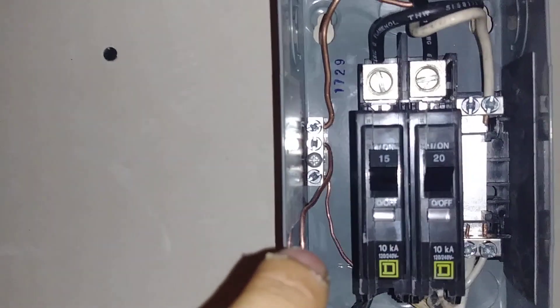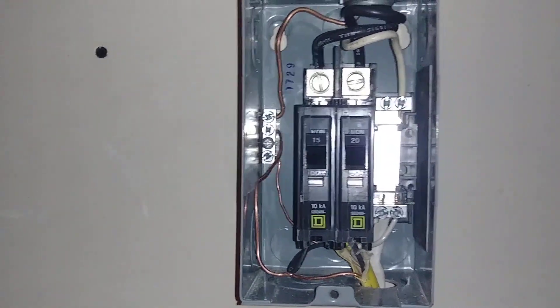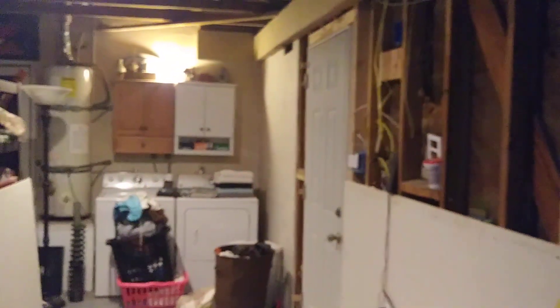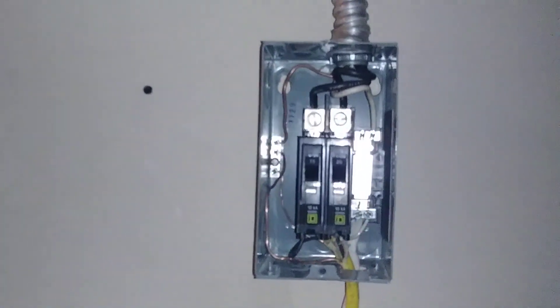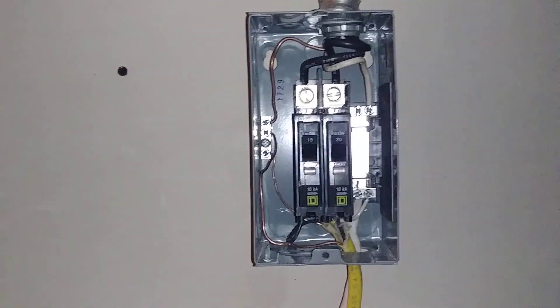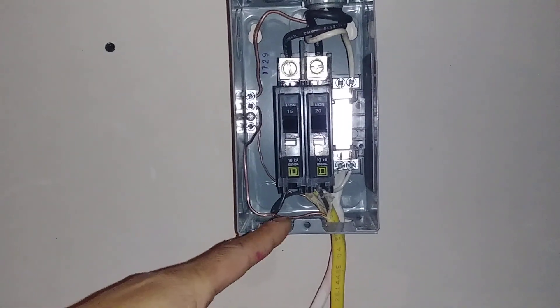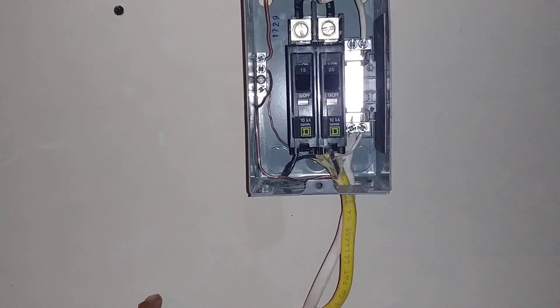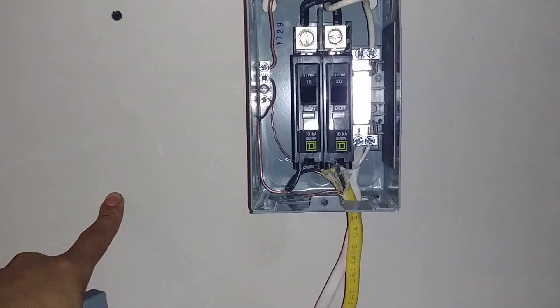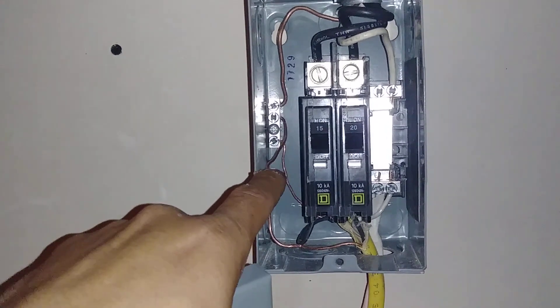The ground wire — let me point at it here — that ground wire is there. So there was no ground wire in that receptacle. I don't know why, I just know that there wasn't any. So I couldn't set up the sub panel over there in the corner to get the wiring on my receptacles and my recessed lighting started. So I had to move the sub panel over here because the main panel is right behind this drywall on the outside. I thought if I moved it over here, it would be easier for me to fish some ground wire into the ground bar on the main panel and back over to the ground bar on the sub panel so I can get started.